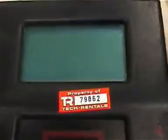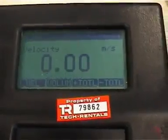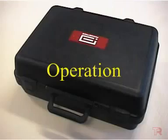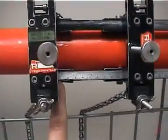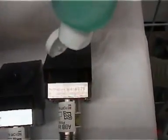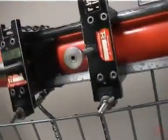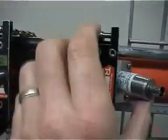We hit exit to take us out, and it'll start trying to set that particular pipe up. We're not on a pipe yet, so it won't be able to find anything. I'll turn the system off and we'll go and set the jig up on the pipe. I've now mounted the fixture at the three o'clock or nine o'clock position on the pipe and set the fixture spacing at 93.8mm. Notice on the side of the transducers there is a scribed line — that 93.8 is the distance between those lines. We squeeze a little bit of couplant onto the transducers — just a blob, not too much, not too little — then put the transducers into the fixture and tighten it, being careful they slid right in.